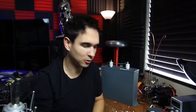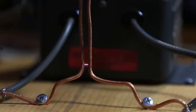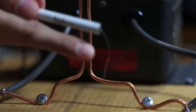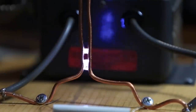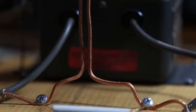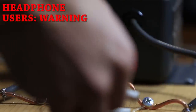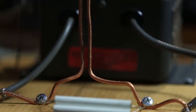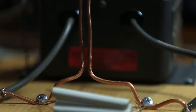Let's see what kind of charge it can hold. So this is my 7.5 kilovolt Jacob's Ladder, 30 milliamp, with no capacitors attached. So this is a 15 kilovolt, 0.47 nanofarad capacitor — like half the size of my finger. Let's just stick it on there; all we're doing is connecting it to the two wires. That's at 0.47 nanofarads of capacitance. Let's put two on there and see what happens. Let's put another one on there. That's loud.